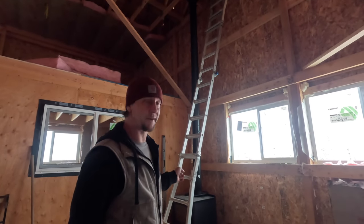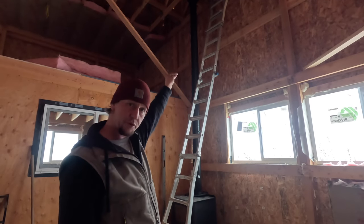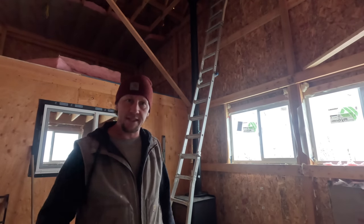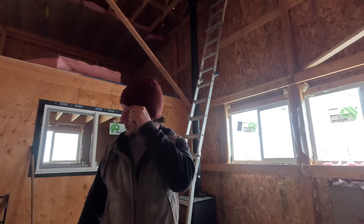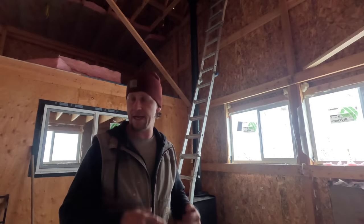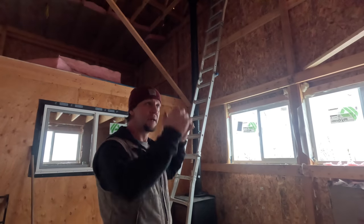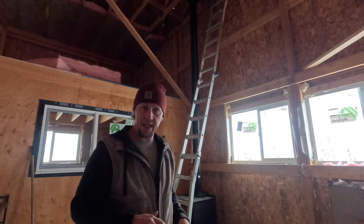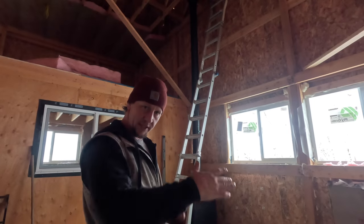Okay, so I've gotten that all back together. So everything's good to here. I'm just under 3 feet to come through the roof. I'm like 30 inches to get through the roof. My insulated pipe sections are 36 inches. So the very next section will come through the roof with about 3 or 4 inches, which means it will be inside the flange of the roof flashing flange. So what I will need to do next is cut the hole in the roof, drop one more section through and lock it into place. I can go up on the roof with the flange, set the flange down, drop the other pipe on, knock it into place, and then be able to install the flange.